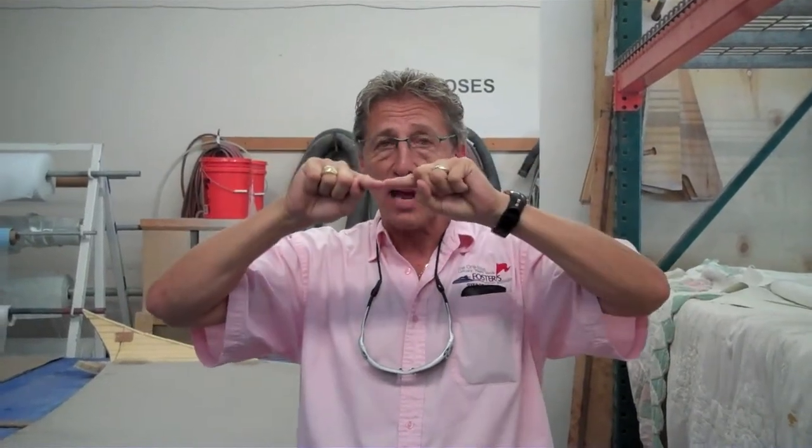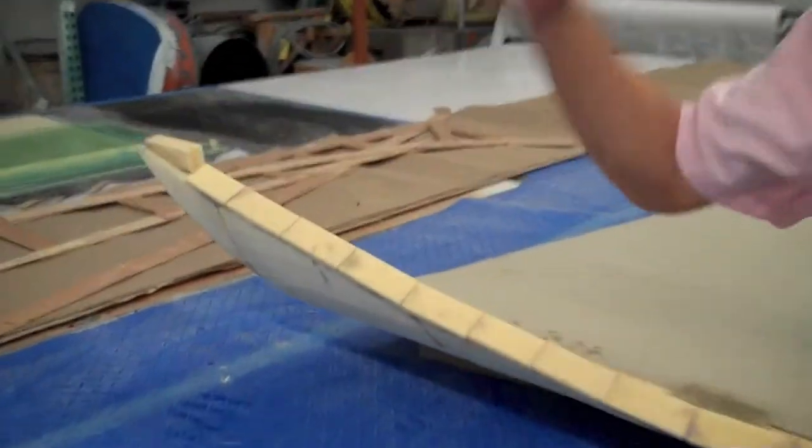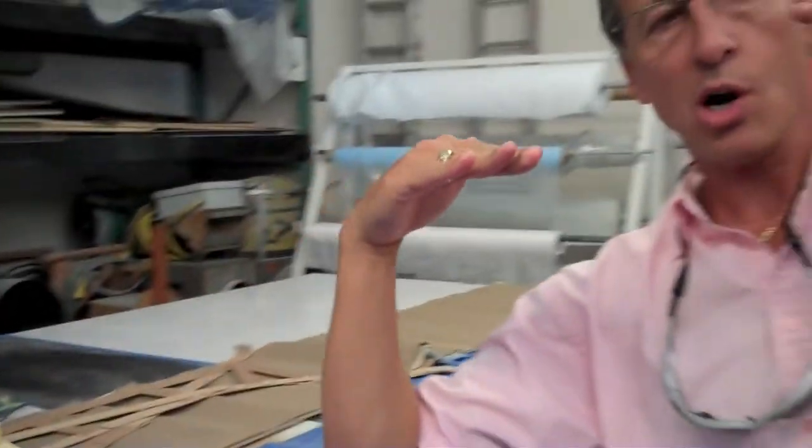When it's finished, we'll put it up there and we'll put what we call a V-brace — two stainless supports on the front. Then we'll put some little tabs that we actually fabricate out of fiberglass, and they'll slide in right here. So from the arch to the new hard top, it'll go like this and they'll fit right in and slot with Plexus and 5200.